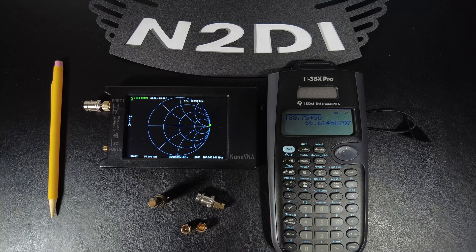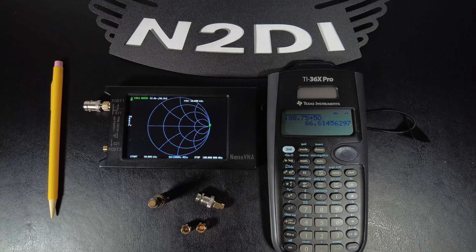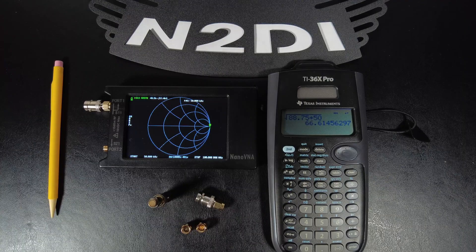That's how you measure the characteristic impedance of your coax. All you need is your VNA, a calculator, a couple of adapters, and your calibration kit. Not only did you learn a couple of methods for figuring out impedance, you also learned what gives coax its characteristic impedance. If you come across a weird piece of coax with weird values, it's probably either poorly manufactured or damaged.